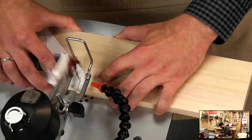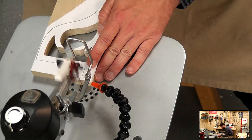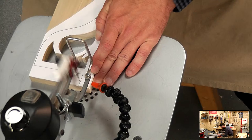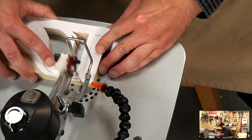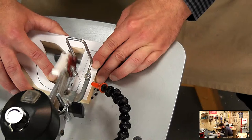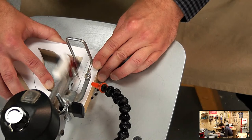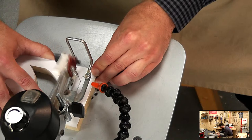So a little cut there, so I can square up on that top corner where it's just planks been machined already. I'm going to cut in here, and then across this long straight again. And I've come off the line a little bit there, but I'm trying to keep it consistent all the way along rather than taking multiple goes at that corner. So it's about a millimeter off, but it's consistent.